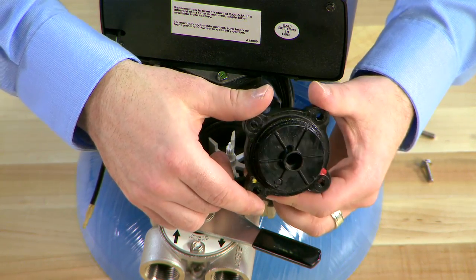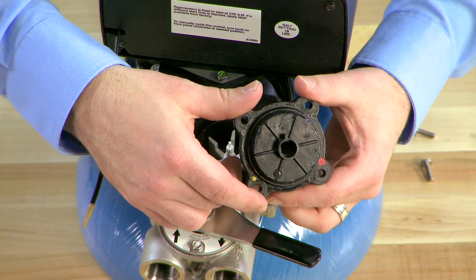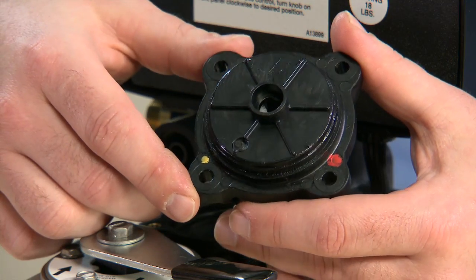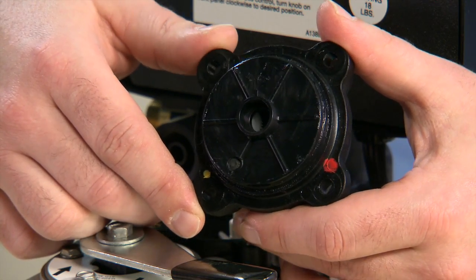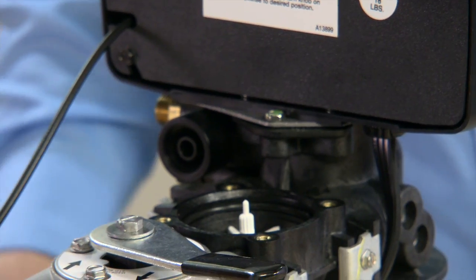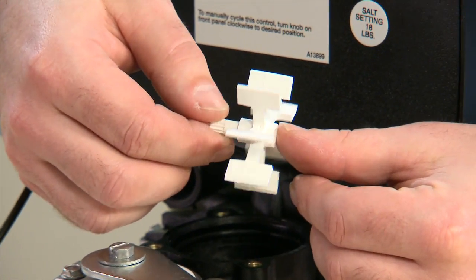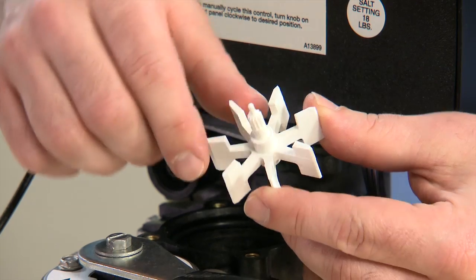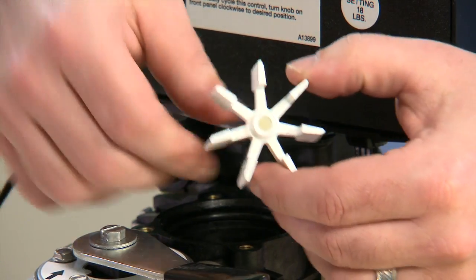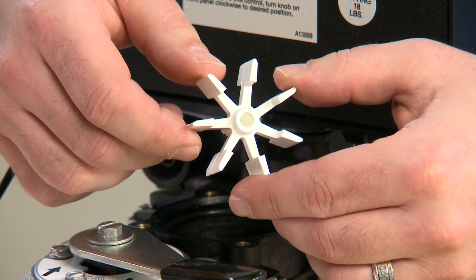Inside this opening, there are a series of gears that allow us to count the water accurately. They are not able to be replaced, so if there is any damage or inaccurate counting of water, we may need to replace the cap. We can then look inside the body at the impeller, checking to make sure all of the gears are solid and there is no damage. We also check the bottom to make sure there is no wear that would cause it to go off balance.